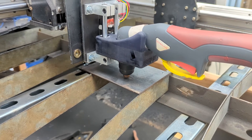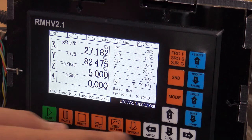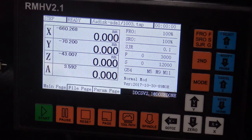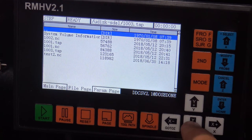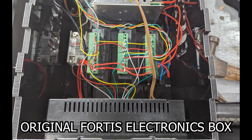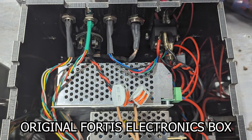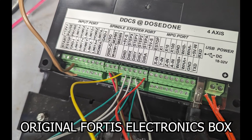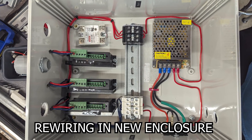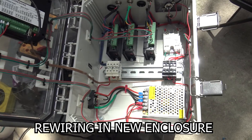At the heart of this project is the DDCS 2.1 CNC controller. Designed for CNC routers, none of this project works without the control board being wired correctly. The biggest issue is that since this controller is not a plasma controller, there's very little documentation online for using it for this purpose. The wiring, material detection functions, and G-code format were all things I basically had to figure out on my own. Since the original router was just a CNC machine, the overall function hasn't really changed. I was able to remove the spindle power supply and a few accessory components and just leave the X, Y, and Z stepper drivers. The machine can now move as it did before.